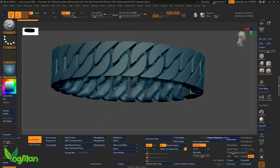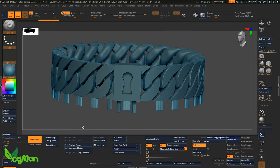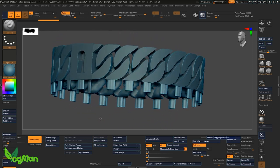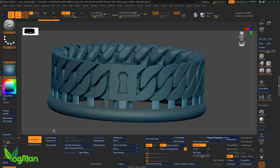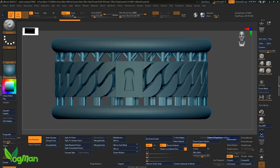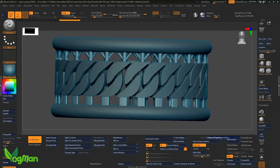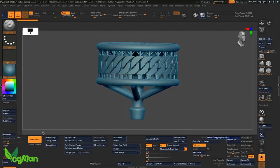To print correctly in place, I needed the supports to also act as sprues. To hold these where needed, I used a ring that would also act as a feeder. But in terms of sprues, these were still too small, so I added an upper ring and more sprue supports to help with metal flow. It's normal to add wax sprues, but I opted to incorporate my sprues into the print design.